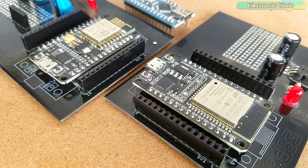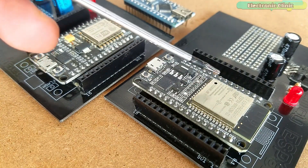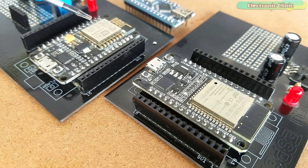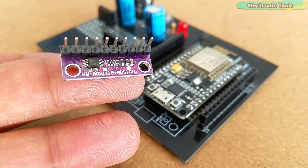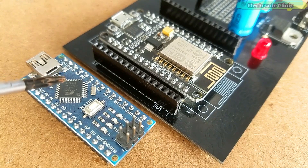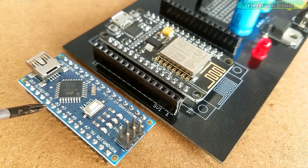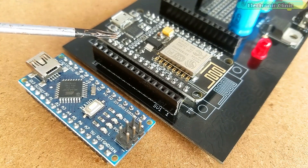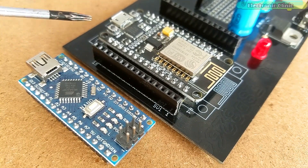There are three options to address this limitation. Number one: you can use the ESP32 Wi-Fi plus Bluetooth module, which has multiple analog pins and can do everything the NodeMCU can. Number two: you can use the ADS1015 or ADS1115 analog to digital converter to increase the number of analog pins. Number three: you can use Arduino with NodeMCU ESP8266, but this is not recommended as it increases project cost, increases coding complexity, and seems quite impractical unless you are working on a very complicated project.